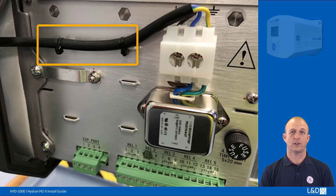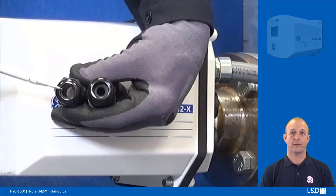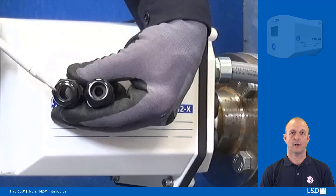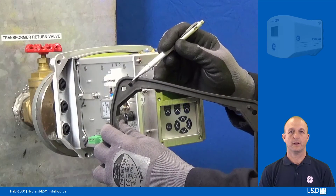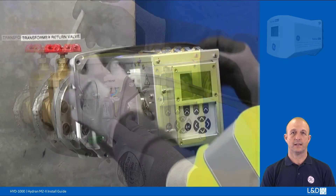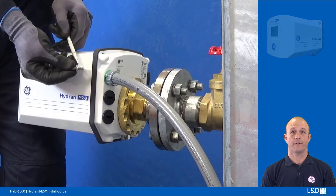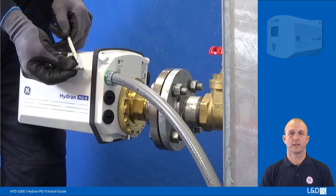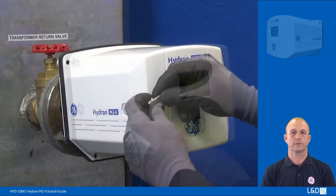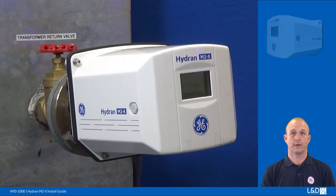As seen here, it is good practice to secure any cabling to the internal body to prevent accidental disconnection. Alternative conduit connectors are available — it is the installer's responsibility to ensure they have the correct diameter for the base plate, therefore maintaining the IP56 product rating. After all cabling, conduit and relay wiring is installed, replace the Hydran cover. First install the rubber gasket using the lugs to align the gasket with the base plate holes, then slide the cover over the main body before refitting the cover screws. Ensure that the locking and flat washers are present — this prevents the cover loosening during prolonged system operation. Whilst supporting the cover, locate the four screws using the cross tightening method to secure the cover evenly without creating pinch points or gaps. Correct replacement of the cover is vital to ensure the IP rating is maintained.